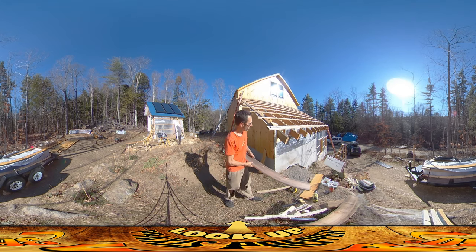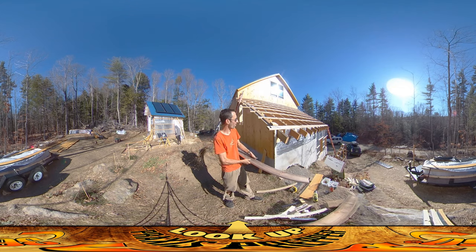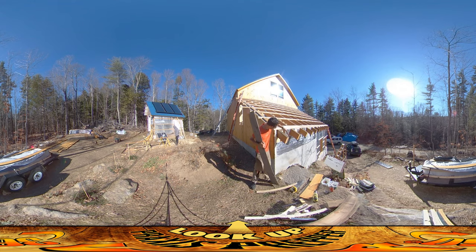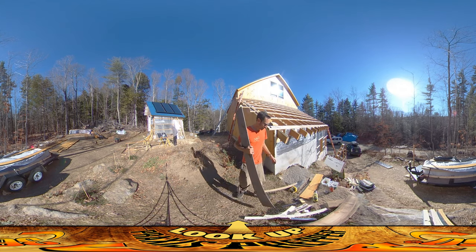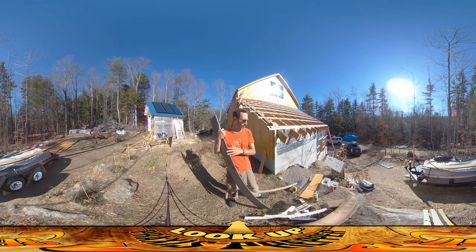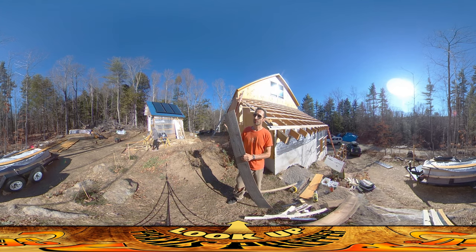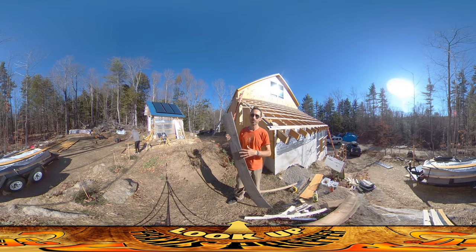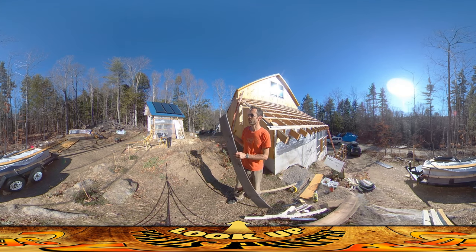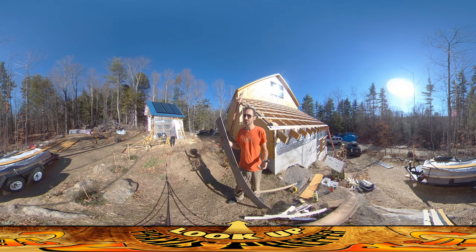What I've been working on today is getting foam on the last un-foamed wall of the house and it's going pretty well. I've got everything done all the way up to here. There's just maybe one and a half square feet of foam in here that I need to finish up with. I've been able to make really effective use of a bunch of the scrap material, and that feels really nice because I tried to be pretty close on the amount of foam on site. Extra screws, extra nails, even extra lumber when you're done is fine, but foam panels take up a lot of room and they get eaten up by mice if you just leave them out.